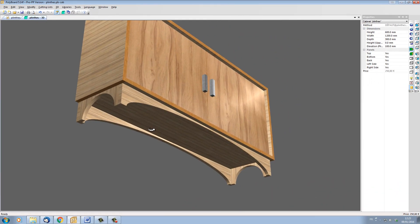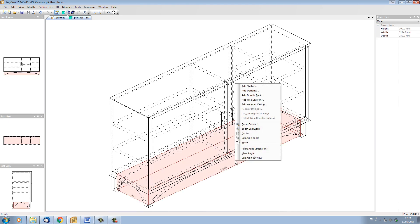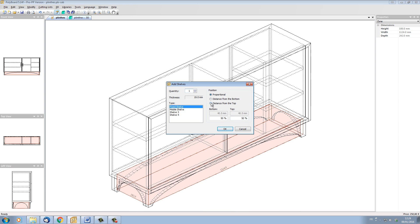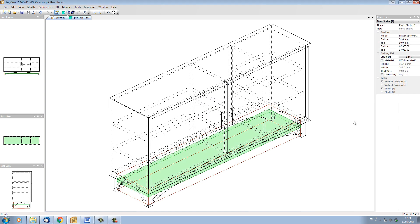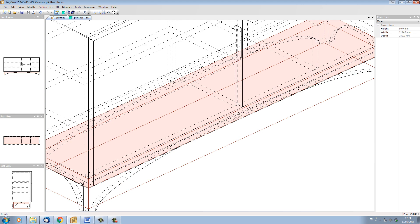Let's go further and say we would like this cabinet to rest on a framed plinth — a frame so that the bottom structure of the plinth area is an autonomous structure. We will need to put across some reinforcing battens going from the front to the back. Let's go into cabinet edit mode, go into our plinth volume, click right, and we can see we can add elements to it: uprights, shelves, double backs. Let's start by adding a shelf at 30mm from the top of this volume, and let's make this shelf a nil panel — so we don't have a real shelf, it's just a virtual shelf which creates a separate volume inside the plinth volume. Let's go into this separate volume and click right.